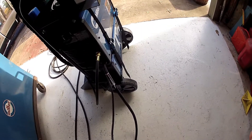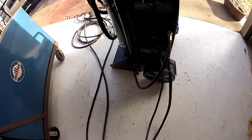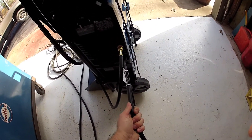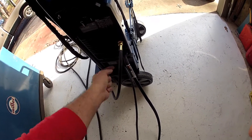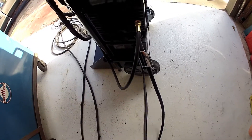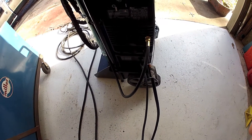Disappointingly, the pump for the cooling system is only 110 volts and they've got a separate cord. Why they didn't piggyback that into an outlet on the machine itself to reduce the number of cords is beyond me. I'm constantly fighting the number of cords in my shop. I may pull a leg out of this power lead and put an outlet here just so I don't have to have this cord draped around the shop.